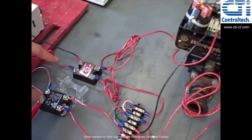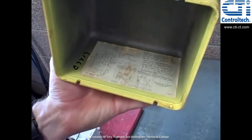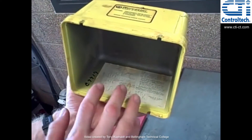We have some solid-state relays here that are controlling the 120 volt power to the motor. The schematic is kind of hard to see in this video, but it's showing a split-winding motor. We can energize one wire or another to make it go in different directions. Pretty simple setup.